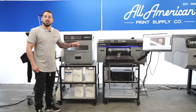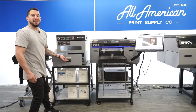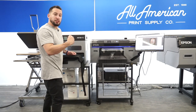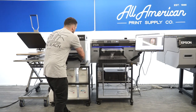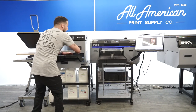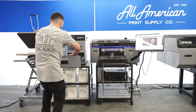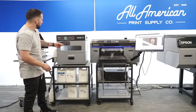I've got my settings adjusted to a 70 and we're going to be doing what's called a round trip, which is two passes of pre-treat. I'm going to extend the drawer out, load in my garment, fold the hood underneath, and fold the long sleeves in half and tuck them into the convenient under-drawer. This keeps things from getting bunched or wrinkled. Now that my settings are dialed in and the garment is loaded, we'll go ahead and hit the start button.